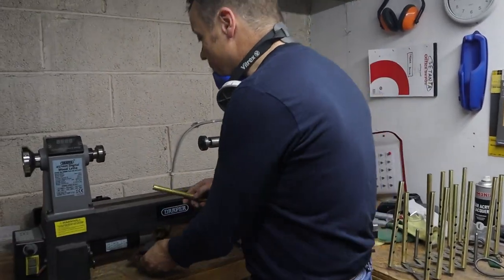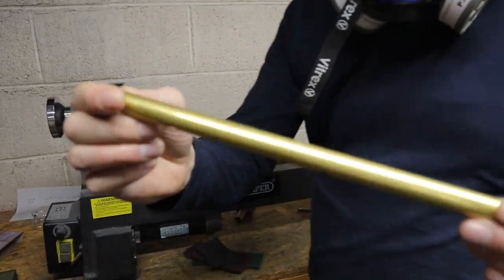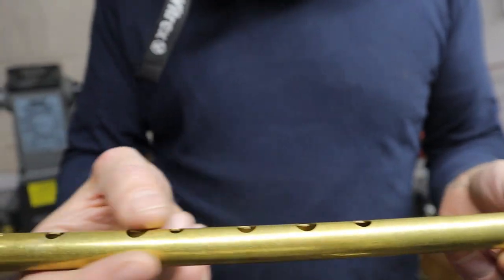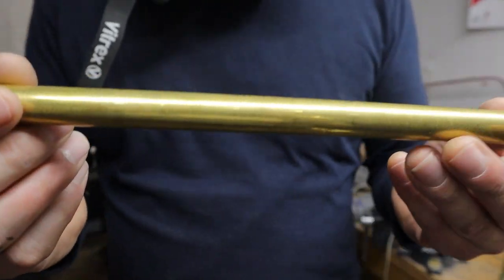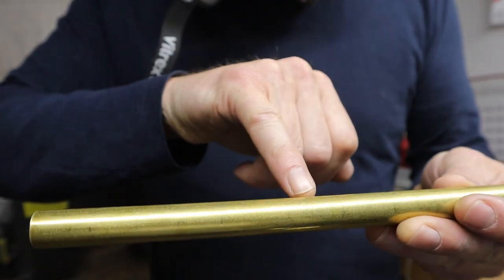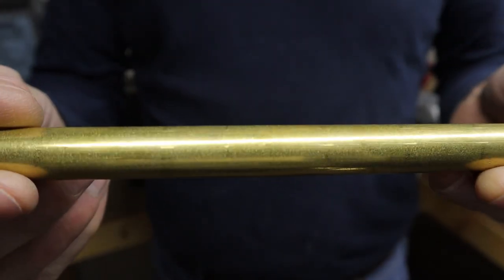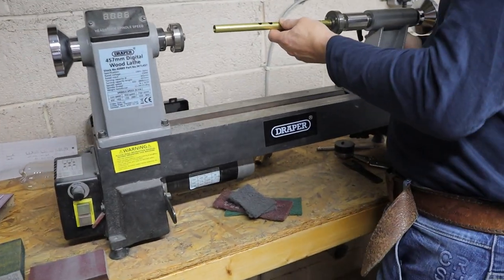The ultra fine gives us our final finish. Here's our C whistle. Even though it was worked and made on a CNC lathe — highly accurate, made to within two thousandths of a millimetre, with drilled holes — you will still get scouring marks from the machinery where it gripped it. So we have to strip all that down.